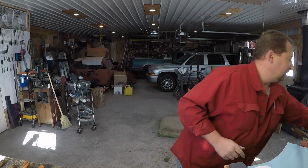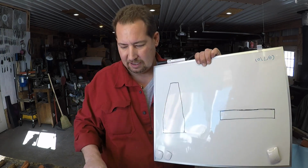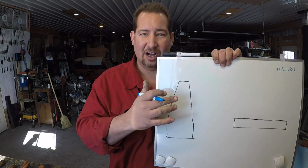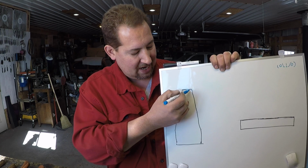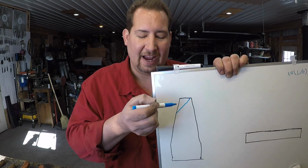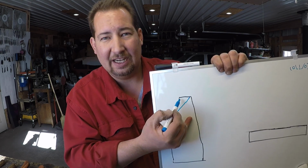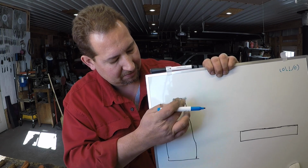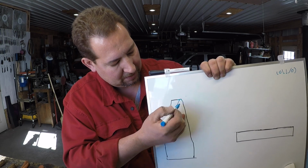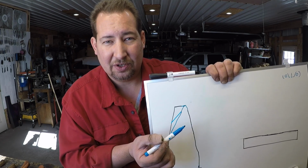In the first video I told you, honestly, that when you're beginning, don't worry about the angles too much, okay? And I got the whiteboard out again. If you have a dull edge like this, you can be really off on a whole bunch of stuff and still take this knife, which at this point right here has no edge on it at all. And even if you just grind one side at a really steep angle, you're going to improve that. Hope that's showing up. This right here is much sharper than this right here, okay? And if you take a couple of strokes this way and a couple of strokes that way, and then come back in and take a stroke, maybe not straight across, and take a stroke this way, you're still reducing that flat at the very edge and making it sharper than what it was when you started, okay?